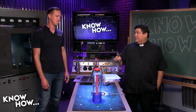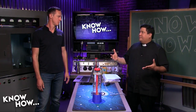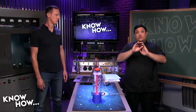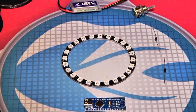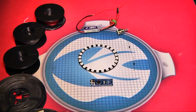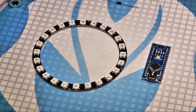The sky's the limit, but of course we've got to start with this one. Let's start with a little overview of some of the parts you're going to need, because you're going to have to order them now. If you want to make this for Halloween, this is the start of October — it's going to take about two weeks to get the parts, and then you've got another week to assemble everything, which should be perfect. You'll need a 24-LED WS2812 ring, an Arduino Nano to drive it, a 3-amp UBEC for the power supply, a 5.5-millimeter power jack, and two diodes.